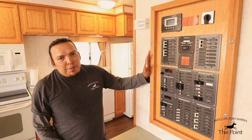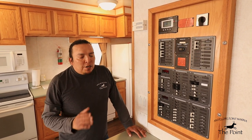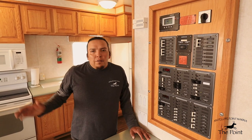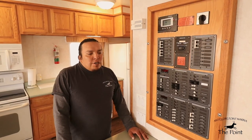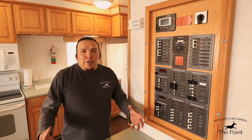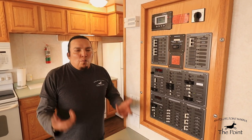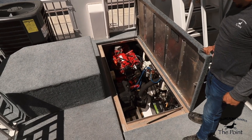Now let's take a look at your generator AC panel. The generator needs to be running in order to operate appliances such as air conditioning, your range, and your stove. The starting sequence begins with another check: first activate your bilge blower switch at the front helm and let it run for at least four to five minutes to bring in clean air and clear out odors from the engine compartment. You can also walk to the back deck, check the swim area to make sure nobody is swimming around the back of the houseboat, and open the hatches to check for any fuel in the bilges or smell for fuel odors.